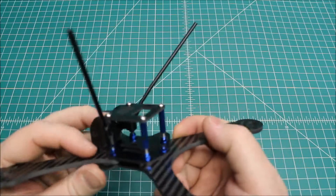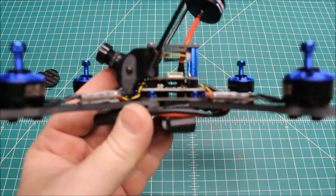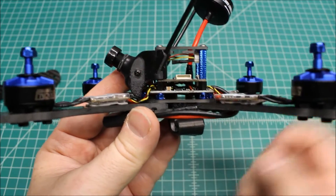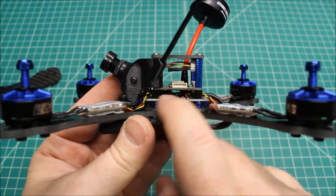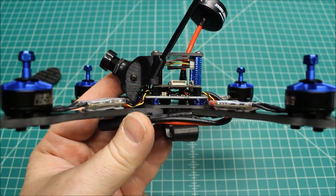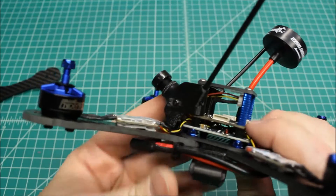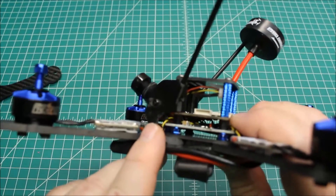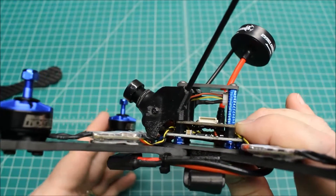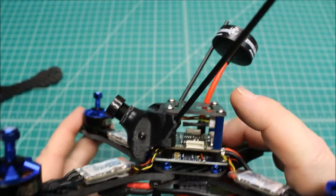I have a finished one here to kind of give you an idea of how the components and everything are going to lay in there. So hopefully my camera's going to focus on this — I'm just learning this camera. As you can see, there we have the screws which were on the bottom, and then we mount the PDB. We've got these little nylon spacers that are in the kit — these little standoffs. Then the flight controller, and then the metal standoffs go above that. Same thing in the front — there's metal standoffs that are underneath this camera TPU camera mount, which slides right on top of it. You're going to need to wiggle and kind of be gentle, but you're going to have to play with it a little bit to get it on there because it's a really tight compression fit.